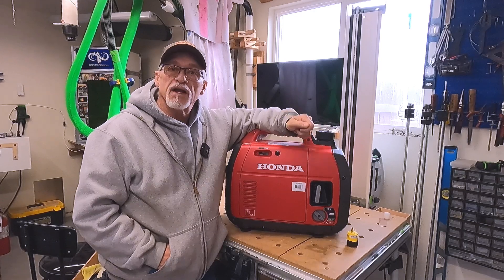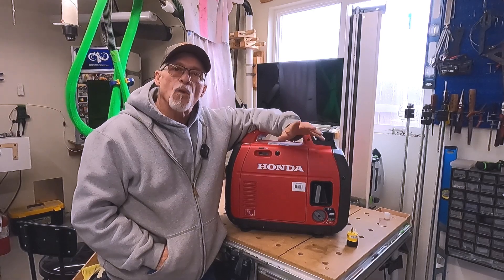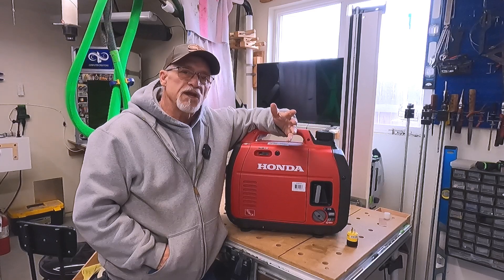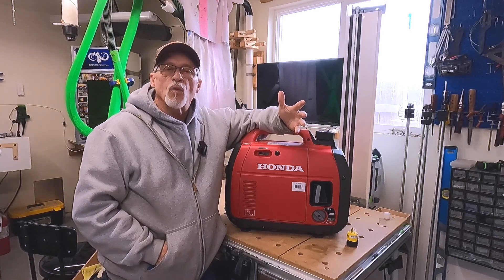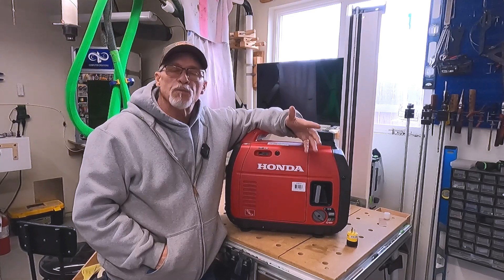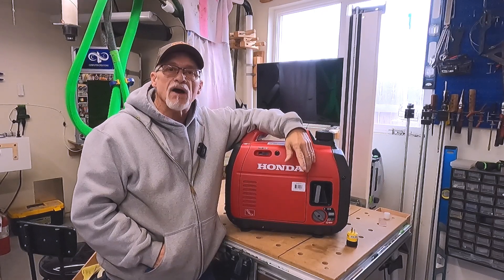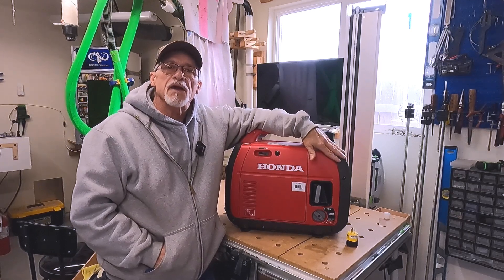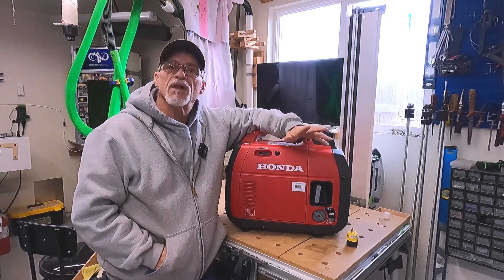It's not that easy, meaning that I plugged my natural gas forced air furnace into this brand new generator, and what would happen is the furnace would only go through about half of its cycle and it wouldn't get to the combustion cycle. That's where the fail safes are built in, apparently. What it is is your printed circuitry in your furnace is looking for a ground potential, meaning that it's tied to ground like you're normally plugged into the house. These have a floating neutral on them, so there is no reference to ground, and so it would give me an error on the furnace saying that there was a polarity issue.